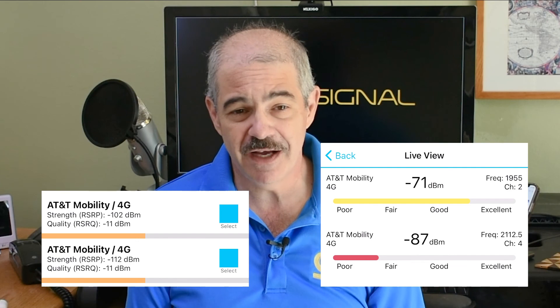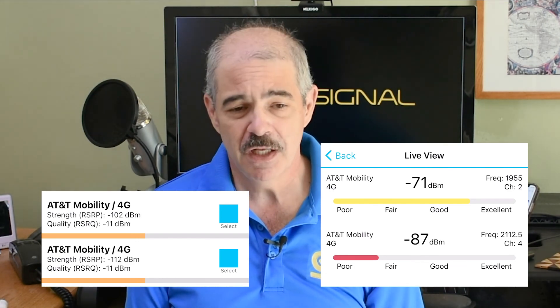What you need to know about the live view versus the survey view is that when you look at them, you'll notice two separate sets of numbers that don't match up. The ones from the survey view are going to be lower — in this neighborhood they're in the negative 100 to negative 110 range — but the live view numbers are more in the negative 85 to negative 90 range. I worked with the folks at Wilson Electronics to find out why. The live view numbers sync up more or less with what I see from other cell signal meters, and the survey view syncs up with what I found in the iPhone's test mode.